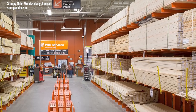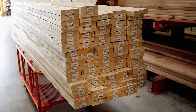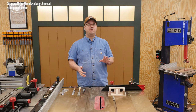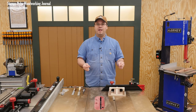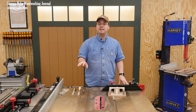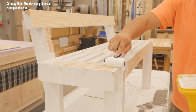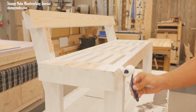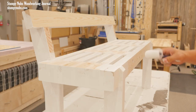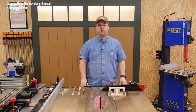Untreated construction lumber such as fir and yellow pine are slightly better choices if you find some that's relatively dry. I've seen pine furniture last several years if it's properly taken care of. That means keeping it well sealed, especially if it's in contact with the ground. The best way to seal pine fully is with good quality paint — keep an eye on it so you can add a fresh coat whenever it begins to crack or flake. You have to keep the water out if you don't want pine furniture to rot.